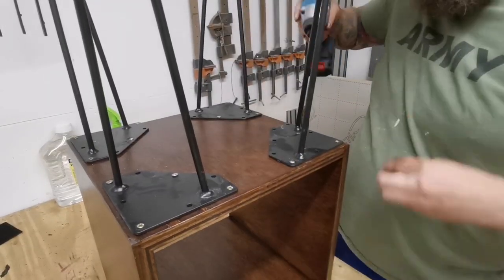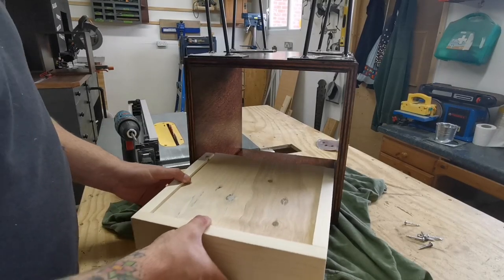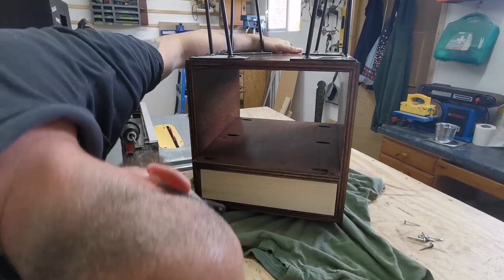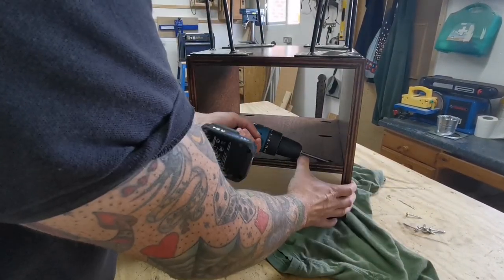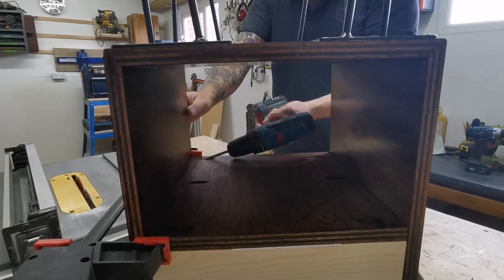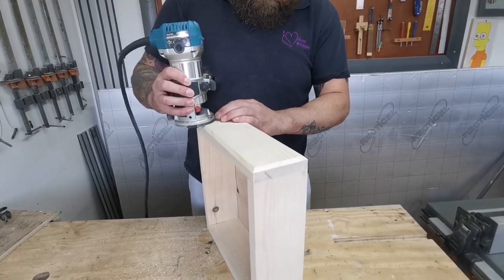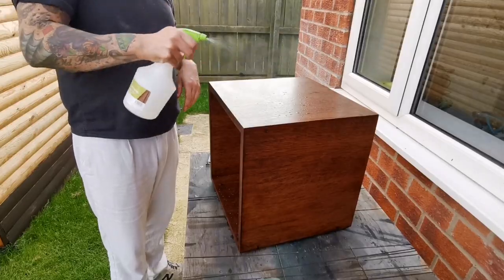I had some hairpin legs left over from a cancelled order and I thought these would look great on this — saved me building some legs. So I applied the legs, put the tray into position with a couple of spacers in there, then put the divider on top and secured it with the pocket hole screws. I wanted to make the drawer look a little bit more interesting, so I put a 45-degree chamfer on all the edges, and when I put the stop block behind the drawer I left it so the drawer was just protruding the distance of the chamfer — I thought that would give it a really unique modern look.